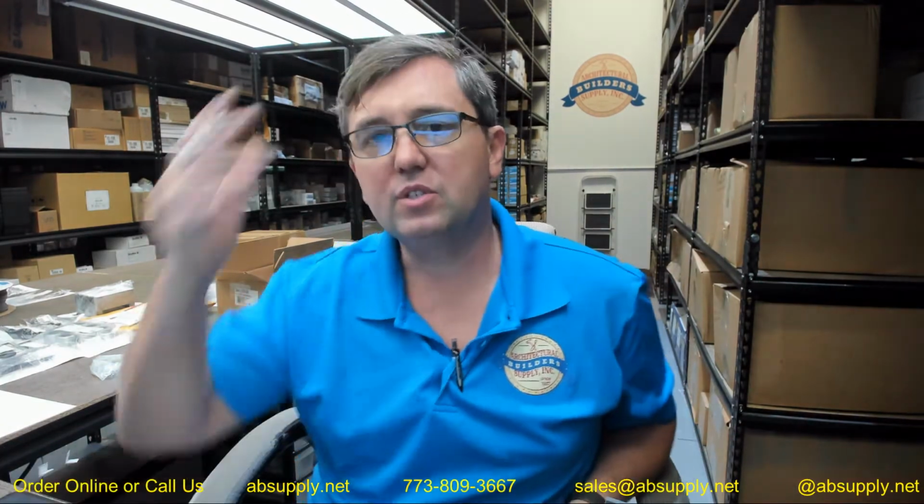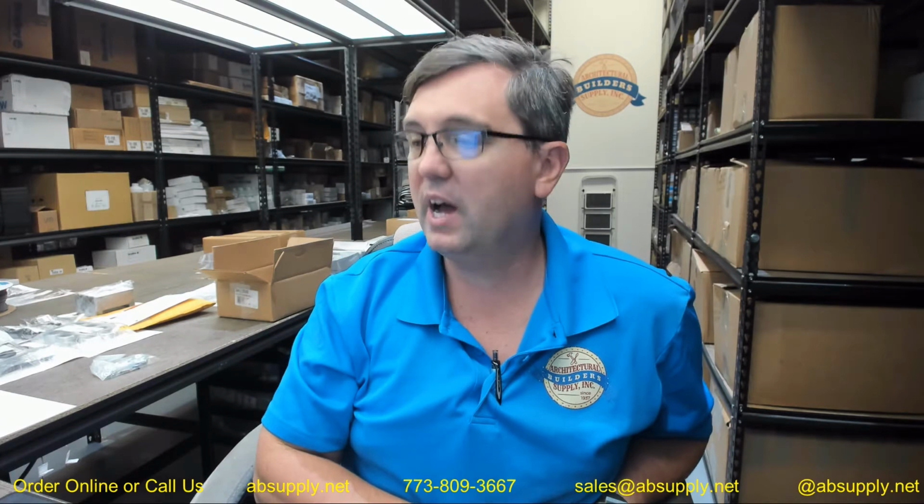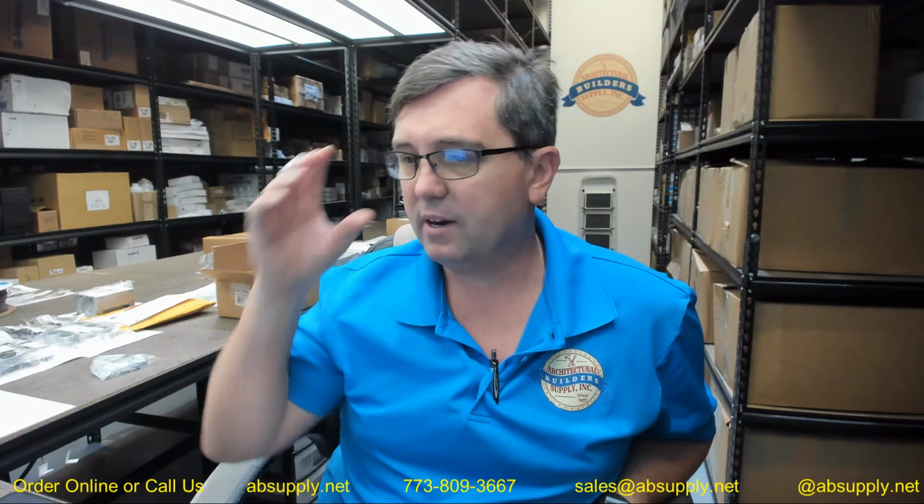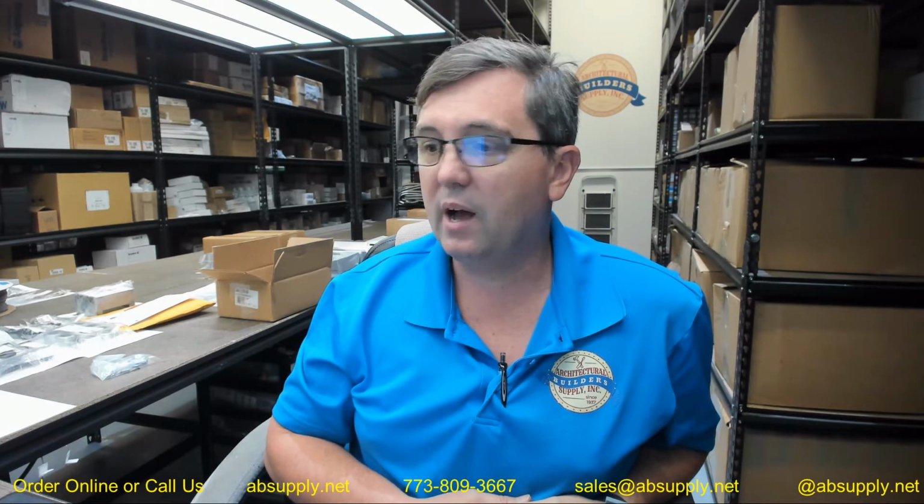Those 5 sizes. Okay. Now, when I'm referring to those different door thicknesses, there is a link below this video to a document called Cut Sheet, and it will show you the table at the bottom based on the door width, its door thickness, and how heavy of a door they're thinking that you're going to swing with it. I mean, you can see that you get some pretty outrageously heavy door weights calculated in. That's in pounds. It's just unbelievable that you can hang a door that weighs 500 pounds on 4 hinges.